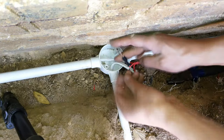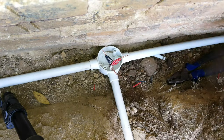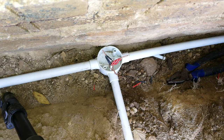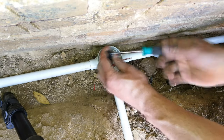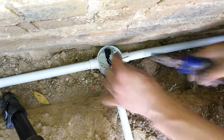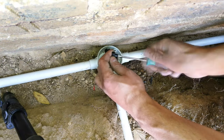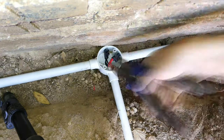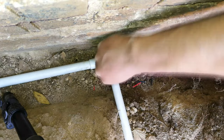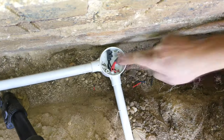Now, please note, some people may be more comfortable using armored cable. Some people will prefer to use steel conduit. And personally, this will be put in cement in my installation, so I'm not so worried about that, but it really depends on the different sites. So just consult your local authority in terms of the standards or the relevant electrical standards to comply. You don't want somebody coming later with a spade or a fork and doing the garden and piercing right through the plastic conduit. Make sure that your work is earthed and protected by an earth leakage circuit breaker.